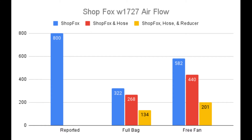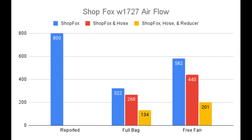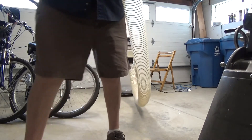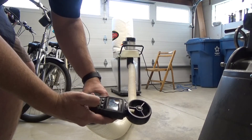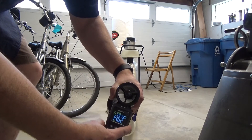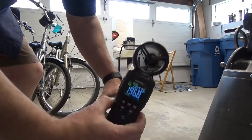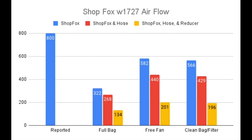The airflow is much improved from the full-bag test I did before. I've reassembled the dust collector — installed the dust filter bag and the dust collection bag — and tested the airflow with no hose attached, with the hose attached but no coupler, and with the coupler installed. The anemometer measures about 197 CFM. The airflow didn't change much with a clean bag and filter, but when the filter bag was dirty and the dust collection bag was full, there was a significant drop. The lesson is to clean those out more often.